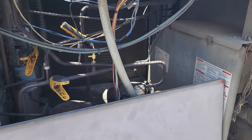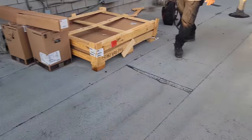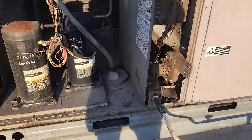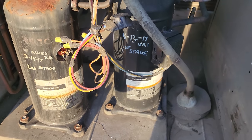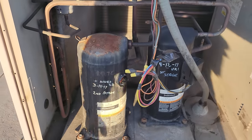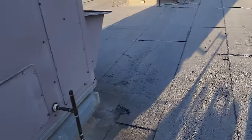Today we've got a big job for this AC. We have an evaporator, two compressors, a drain pan. One compressor has a grounded compressor and the other has a plugged up fixed orifice metering device. The two compressors in there aren't the same - capacity is slightly off - but we're going back with the proper compressors, two new dryers, and a new evaporator. Hopefully we get this thing all dialed in. Then we've got to do that other one next, but right now let's focus on this one.